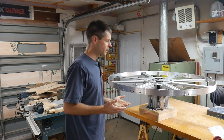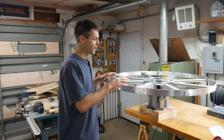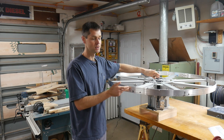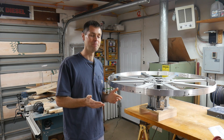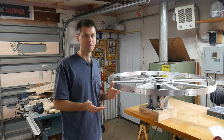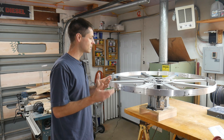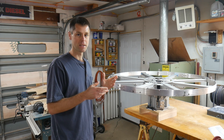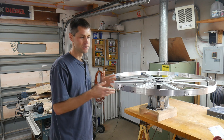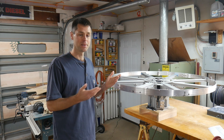There's also material flex to consider. The second thing is tolerance. My nominal gap between the panels is 130 thousandths, which means that ideally you'd want significantly less than that variation just to allow for extreme conditions. Let's go with a quarter - that gives us about 30 thousandths that we want to stay within. 30 thousandths over 30 inches is 0.1%, so we're aiming for 99.9% accuracy, and four times that would be out of our band, so 99.5% is a fail condition. The third thing is synchronization - being in the right position doesn't matter if you're in that position at the wrong time. The fourth is cost and accessibility. You cannot just buy your way out of a situation here by saying we're going to get ultra-precision such and such or use some exotic materials. I need to be able to build it here in my garage, which is fairly well-equipped for a garage but nothing exotic. And if other people want to build it, they're going to have to build it in a similar workshop too.